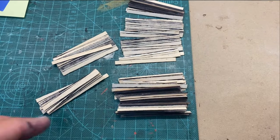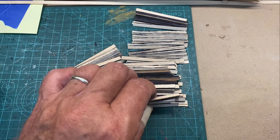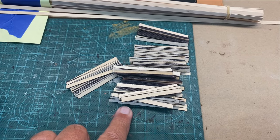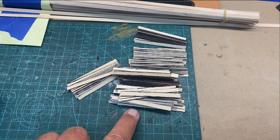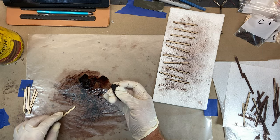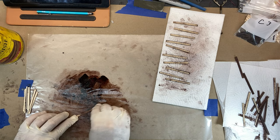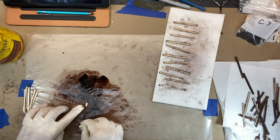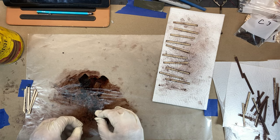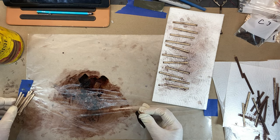This is my first grouping — I need 266 of these. I'll cut the rest when I need them. I'm also going to pre-stain these so I don't have to worry about getting glue on them and not being able to stain them. I put a little bit of stain on a small piece of cloth — not a lot — and I rub it on one side. I don't want to get it too heavy because I don't want it too dark; I want those black edges to show through. I do not stain the back side, that's going to get glued down anyway.